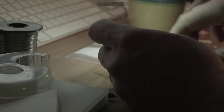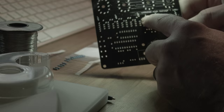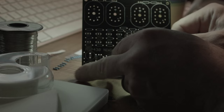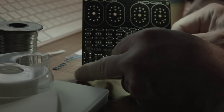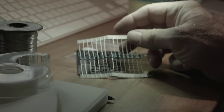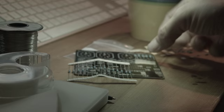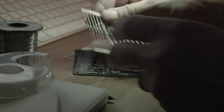Rob has his instructions online, and as is true with most of these kits, you get a very nice circuit board. He's done a really good job with the silkscreen — he's got images of the parts, and even on the back he's got warnings for high voltage. This thing is going to generate 180 volts from a very simple 12 volts. The first thing we usually do with these kits is put the resistors on because they're the simplest. If they're taped up together, resistors of the same value will be taped together.